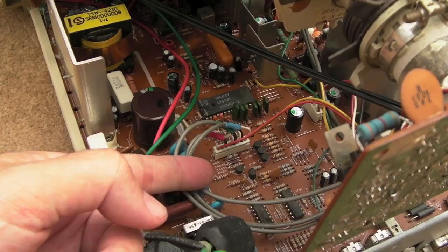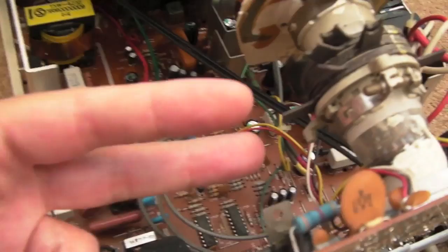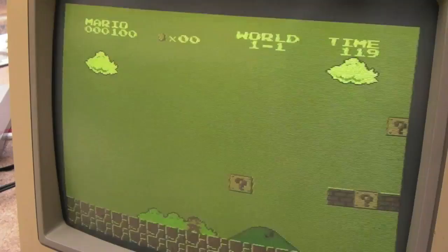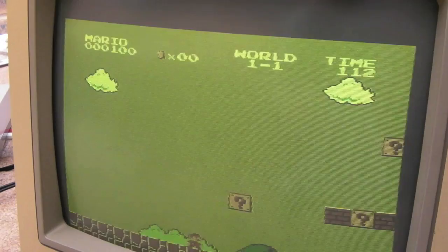So it is a bit of an odd one. It could be something on here that's temperature sensitive - I've measured things like the transistors. I'm just wondering if when you switch it on, as soon as it gets a bit of load there, suddenly something's changing until it's warmed up fully, we've got a problem. So yeah, right now I'll swap out these three caps and let's just see what happens.